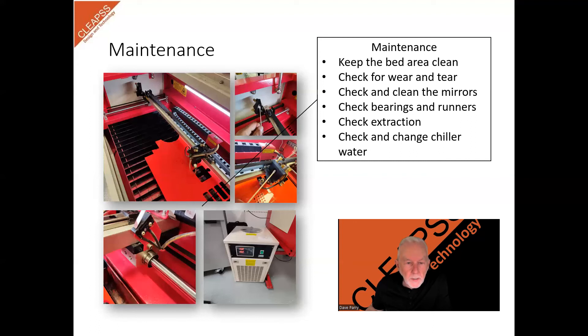Most laser cutters do not need any parts lubricating, but you should check with the manufacturer, as it may be good practice to inspect and where needed add suitable lubrication to bearings and spindles. As laser cutters are large machines, they do not tend to move around very much, but if they are still plugged into the power supply with a three-pin plug, they will need a periodic portable appliance test. The outside of the machine should be cleaned and checked to ensure that all the locks and interlocks work as they should, and there is no damage to the shell, as this is part of the safety system, blocking the potentially dangerous optical radiation from the laser, as well as containing any fumes.